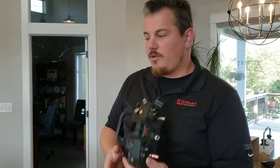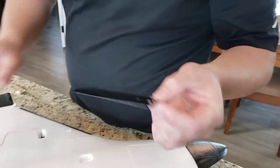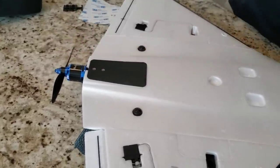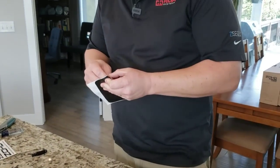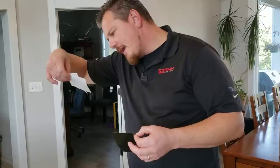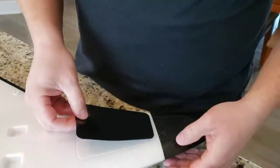This is the plug-and-play version — they also have an FPV-ready and a kit form. The specs: 650mm length, 620mm wingspan, recommended 4S 2200 or 3200 50C or higher. The radio setup is next. We've got an iRangeX RM601 micro six-channel receiver — very light, comes from Banggood. It can do PPM output if you want a flight controller, or you can use one of the six channels. It comes with a bind plug. We're also using an NX3 three-axis stabilizer gyro. It's got some double-sided tape. The NX3 instruction notes that the controller has to relearn center position after installation or any trim/sub-trim change — to do this, quickly flip the flight mode switch twice between rate mode and hold mode within one second.